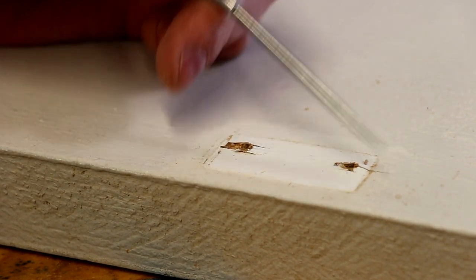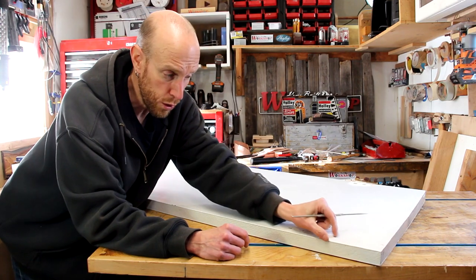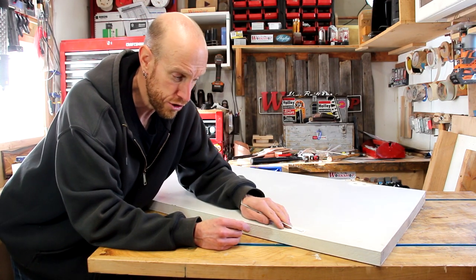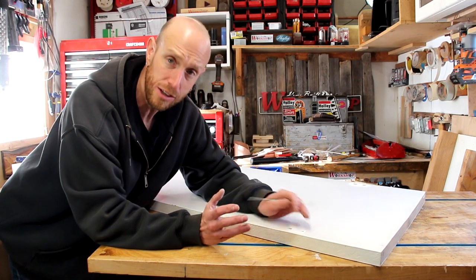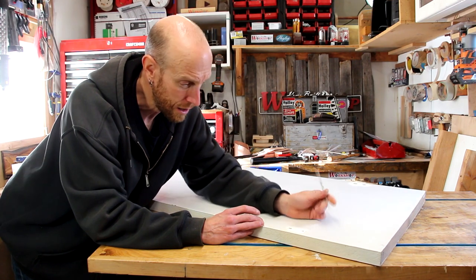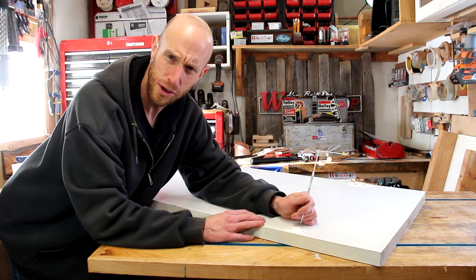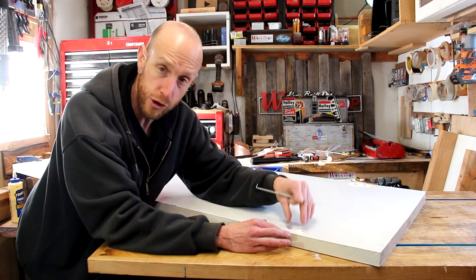It also looks like I'm going to need to repaint — there's a couple of different colors of paint on there. We'll take care of that later. The reason I wanted to check that is because if this was in that wooden strip that runs down the side, I could probably just drill this out, plug that hole with a dowel, and then it's going to be back into hardwood and I could just reattach the screws. But the strip of wood is just to the side of where these holes are. So I can't just glue a dowel in there to reattach it in the same location. What I'm going to have to do is basically plug this hole and then reattach the towel bar in a different spot using the correct anchor. This was not installed correctly — the screws were just run straight through the thin wooden skin, which gives it absolutely no strength. So if some mysterious person hangs on it, yeah, it's going to rip it right out of there.